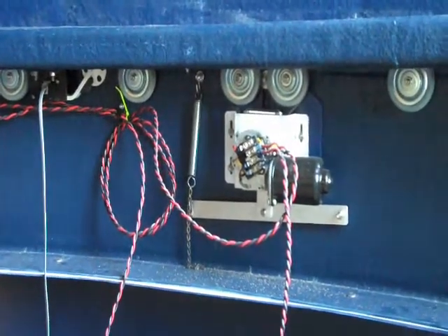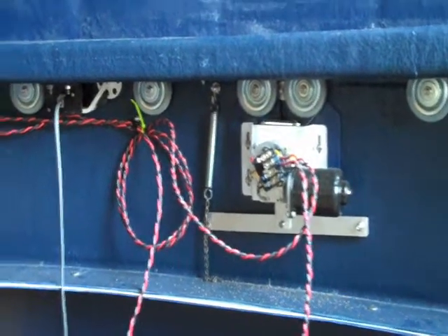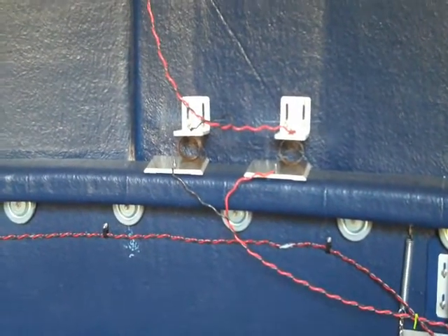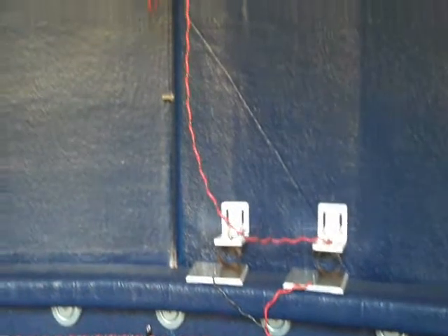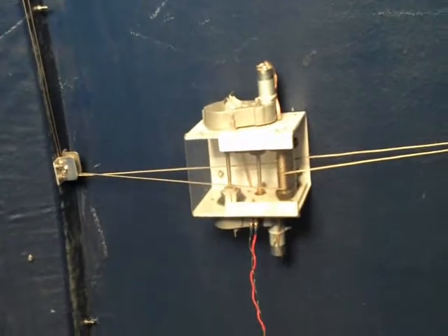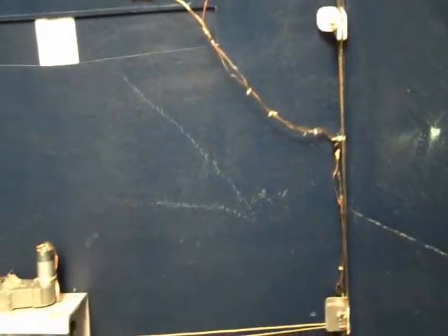This is from the right front rotation motor looking counterclockwise around the rest of the dome. Just passing right here, those are my shutter home switches going to the shutter relay. Going up here, there's the shutter relay. Going to the shutter motor and then up to the contact switches. Note the crisscross of the cable.